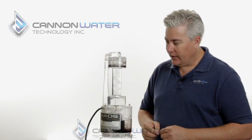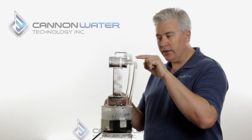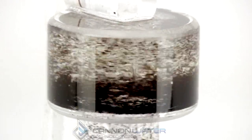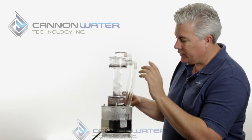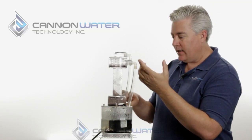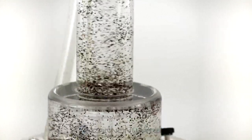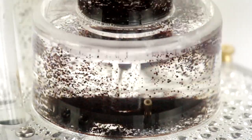As you can see, we're pumping the dirty water with particles up into what we call a tangential connection on the inlet tube. It spins around the inside of the top of the separator — you can see there are some slots, and these slots help create a vortex. That vortex causes the sand to spin around the inside of the chamber, and the heavier material starts to drop toward the bottom.